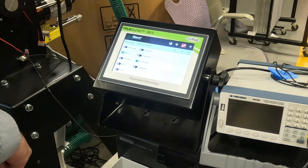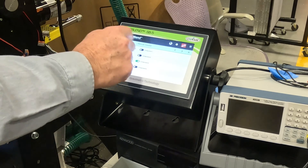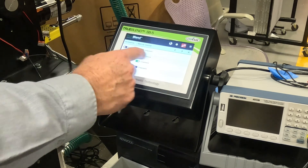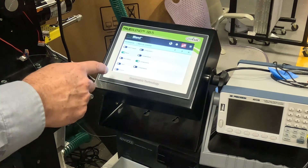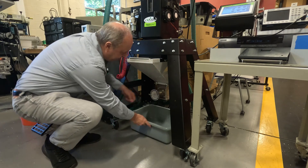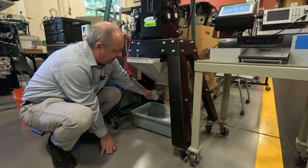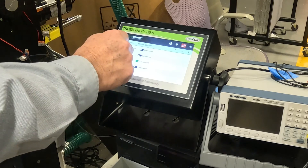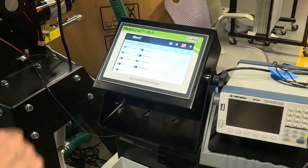You could open up the mixer — which is the valve below the mixer — and open up the batch hopper. Let's say you wanted to drain it without using the chute: you could just put a pail below the stand. There's a valve that you can open that would allow you to drain the blender all the way down through the stand, by opening up the batch hopper, opening up the component you want to drain, and the mixer, and drain everything out that way.